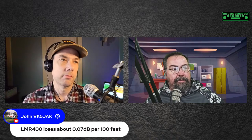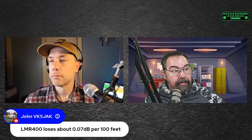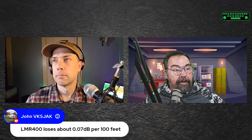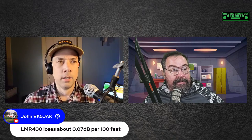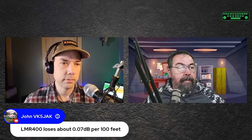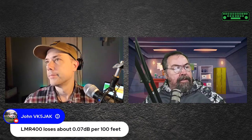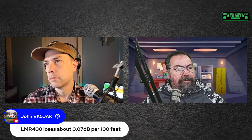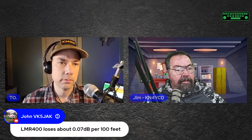Right. And someone mentioned it. There are a bunch of coax calculators on the internet that will let you find out what the loss is on a specific type of coax. And almost all the coax sellers have data charts for their specific coax they sell. So M&P's chart may not agree with something from DX Engineering for a given type of coax, whatever. And isn't RG213, I have the DX Engineering version of that. Yeah, that's what I have. And it's great. I think it's functionally the same as LMR400, if I remember right. It may not be exactly, it's close.